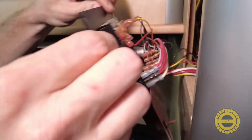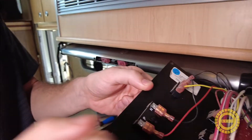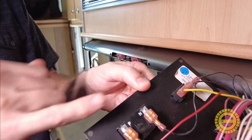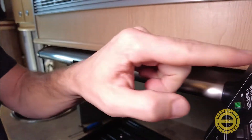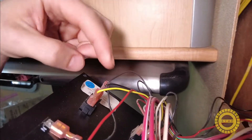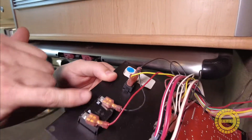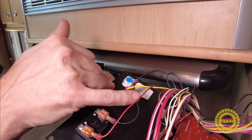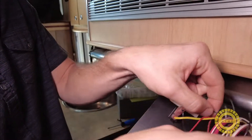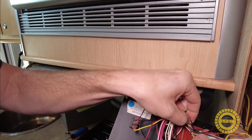On the back side here is our hour meter and we can see we've got two wires: a red wire and a black wire — the P may mean positive, the N may mean neutral. Over here on the start/stop switch we have a yellow wire coming out from the side that would indicate stop, and on the start side we have a brown wire. We also have these two black wires in the middle. When you see a wire jumping across from one switch to the other, this is most likely our ground wire — it's usually black or brown. Following this all the way back, we go through here.